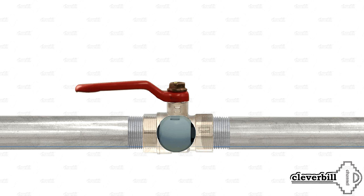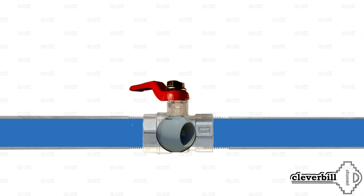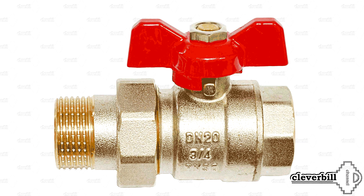Another disadvantage is that most ball valves are a non-collapsible structure and therefore, when damaged, must be completely replaced. Also, the ball valve requires periodic opening and closing — similar to the stop valve — because over time, salts can be deposited between the ball and the body, creating an obstacle to normal rotation and in some cases even damaging the seals. And yet, with all these disadvantages, the ball valve occupies a leading position in terms of use in household needs, and in particular in home water supply.